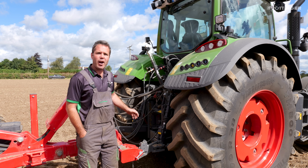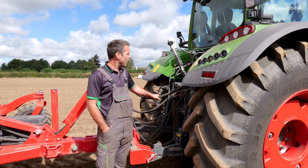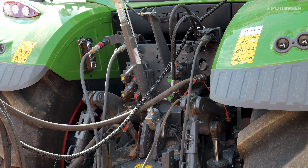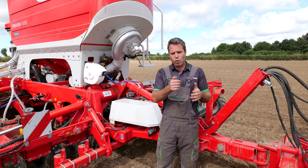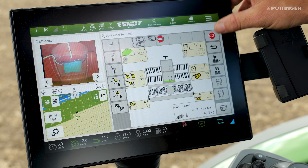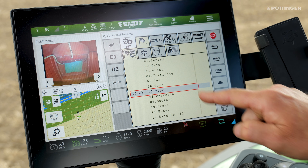The first key feature starts with the connection to the tractor. We're going in through the load sensing of the machine, so just three pipes on the hookup — very easy to hook on and off. We're not fighting with spool valves and flow rates or trying to remember where we were last season. With the ISOBUS joystick, you can assign lifting and lowering to the joystick, all done through the load sensing. Today we're only using the Fendt ISOBUS system, controlling all our assignments, with the control box used for visual only.